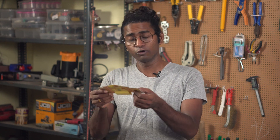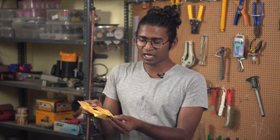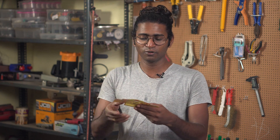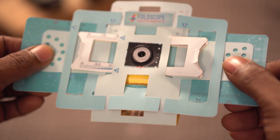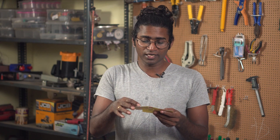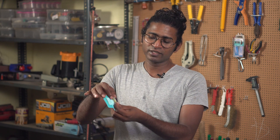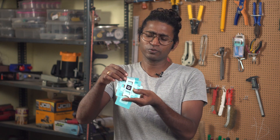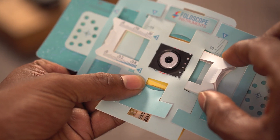In this paper microscope, there are some design issues. When you lock the sample, you lock it using magnets — that is a good mechanism. Focusing is important because the lens distance is about 2–3 mm. The paper is folded to a thickness of around 4 mm, making the lens sit slightly lower — that is the focusing distance. There are some problems with my design that I am working on.